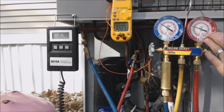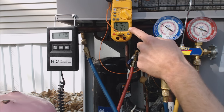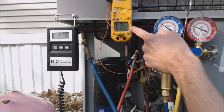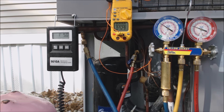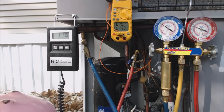Just to illustrate — say we wanted to check if we were at 19 degrees of subcooling yet. We'd look at our pressure. At 233 psig, using the pressure-temperature chart — DuPont makes good ones, but they're also on the gauge sets — that works out to about 79 degrees saturated for R-410A. To achieve 19 degrees of subcooling, we would actually need the actual liquid line temperature down at 60 degrees. That's because we're taking the pressure off the hot discharge line, and the manufacturer is telling us to take the temperature on the liquid line. So this procedure is different from standard.